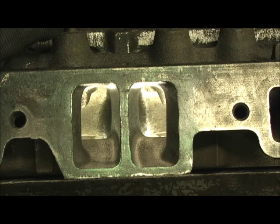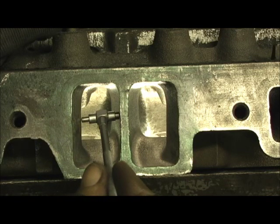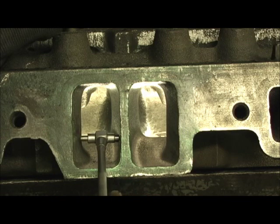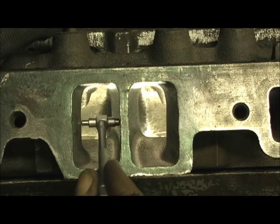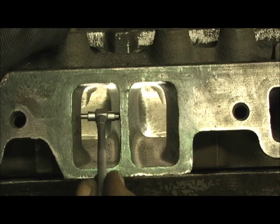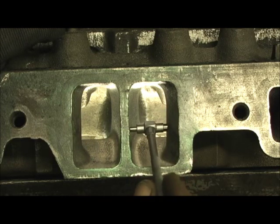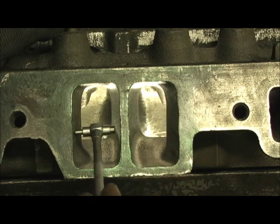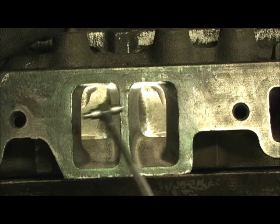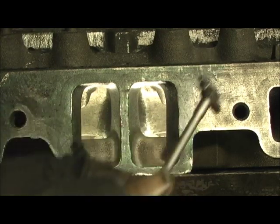I've actually moved this about 125 thousandths. I take this and go down through there — of course it ain't gonna be exact at the top or the bottom, but as you can see right here it's almost exactly the same. I come over here within a thousandth or two, almost exactly the same. It stops right around there — little pinpoints — and it does the same here. That's going to be my measurement.